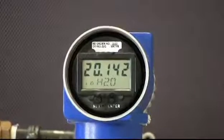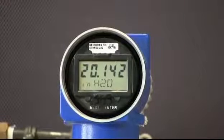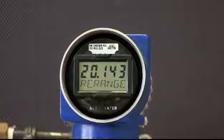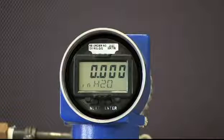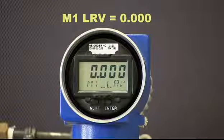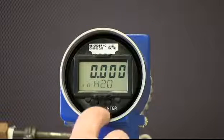The first step is to determine the actual tank level — in our case it is 15 inches. The next step is to temporarily set the M1 LRV value to the actual tank level using the push buttons located below the LCD. Press the Next button and Re-range will be displayed. Press Enter and M1 URV will be displayed. Press Next and M1 LRV will be displayed. Before proceeding, make note of the M1 LRV value — in this application it is zero. Making note of this value is important because we must restore it later in the procedure. Now press the Enter button.